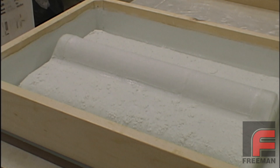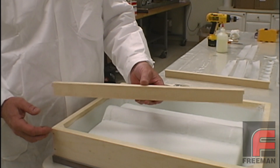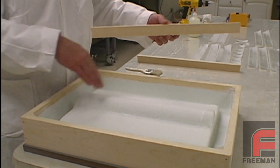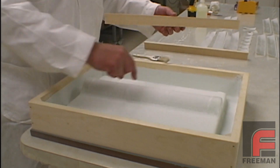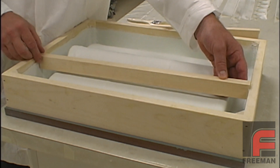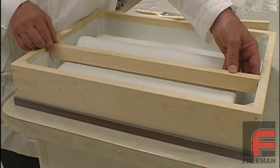The next day, our fourth and final layer of fiberglass and resin has cured. Now is the time to install the support bar. We do this because of the large expanse lengthwise, where the tool is only connected to the mold frame on the perimeter. By adding support bars across our frame, we add significant strength, rigidity, and stability to the tool, without adding much weight or cost.